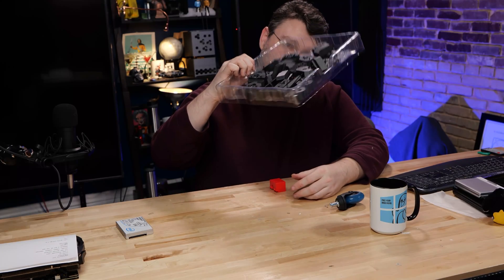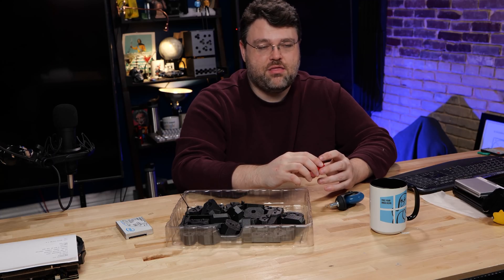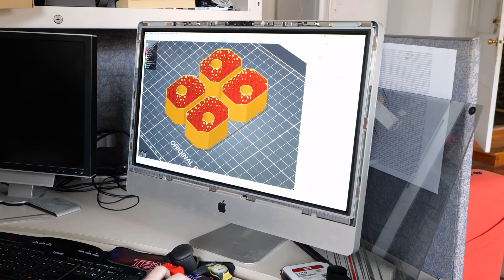I tinkered with it, and this first prototype is basically just a block to hold a wheel. These worked okay on hardwood floors, but on carpet where there's more resistance, it really tugs on the screw hole of the case - not an ideal situation. This tub has all the different iterative designs I went through. Most of the time I use very simple CAD tools - I actually had a lot of training with AutoCAD and AutoLisp.